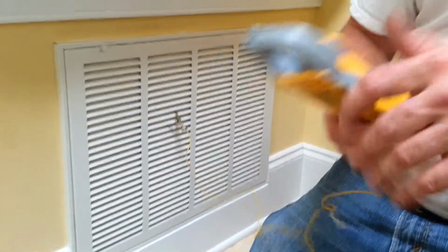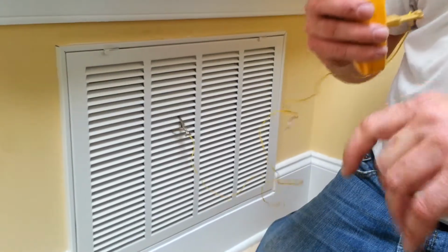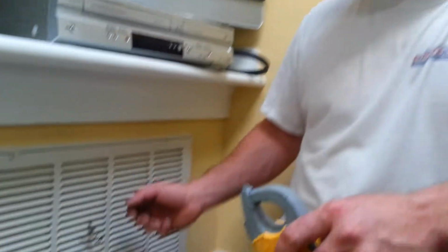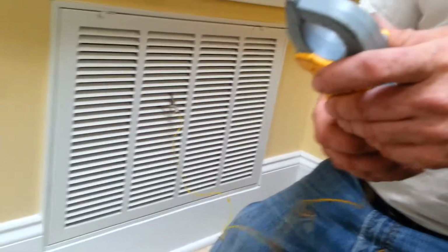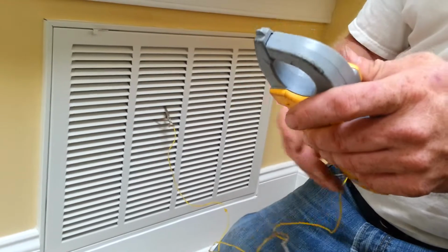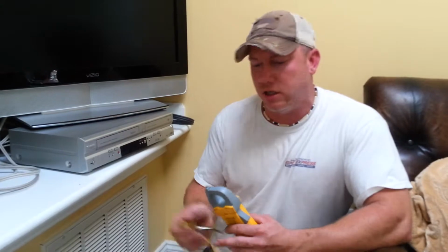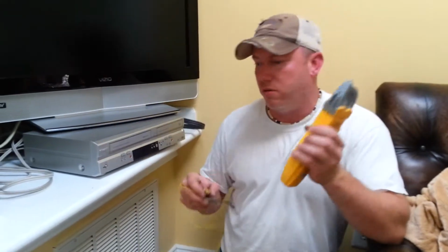and you're going to select your temperature, and basically what is happening is the air rushing by this wet sock after it's been in there a second is causing the evaporation. So what we're truly finding with wet bulb is what we call the evaporation rate, or the evaporation temperature. So right now we are showing a 66.9 evaporation rate, and so that's the easiest way to get your wet bulb with just basic stuff that would come with, let's say, a Fieldpiece meter. These probes come with your meters.